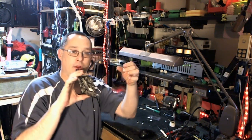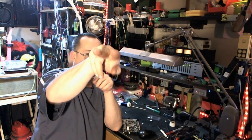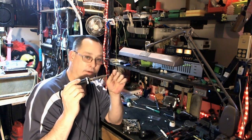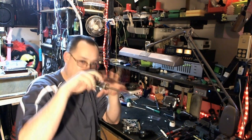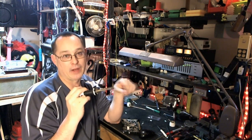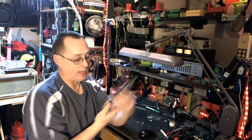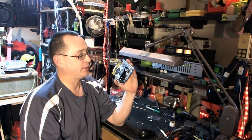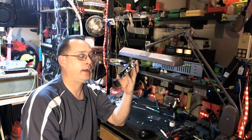With a little bit of pressure side to side — rocking it — it came right out. Another way you could do it is take a little bit of solder, put a blob on the end of your tip, and put that blob on top of the pin on the back, so you've got a big bubble of solder that heats it up and distributes heat evenly around there, then pull it out. I replaced initially — I found one of the values and bought a five-pack of the others. There were two values of capacitors that had blown — four total that failed.